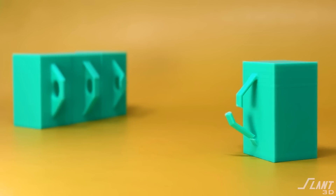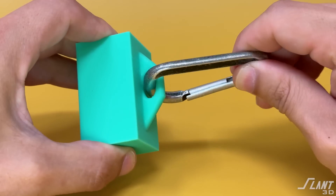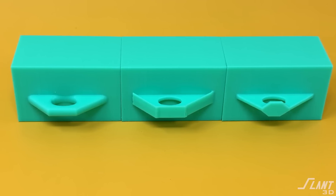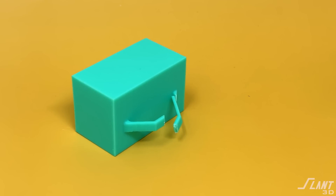You can have them loop the entire part or whatever it happens to be in order to make sure that they're reinforced and strong. Ultimately what you're trying to do is add more material and more reinforcement around the pullout area to make sure that it's strong and reliable. Do not just leave a simple plane of vertical layers on the outside that's going to be thin and delicate. This way you can make a part that's really robust, can last as long as you need it to, and can actually replace a traditionally manufactured part very reliably.